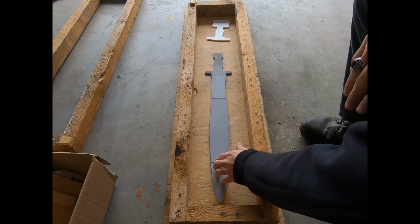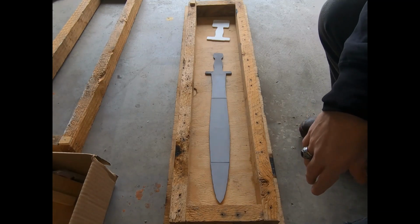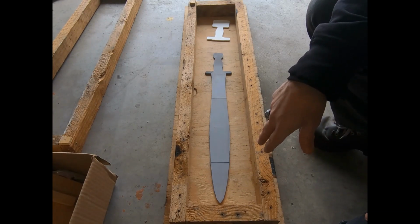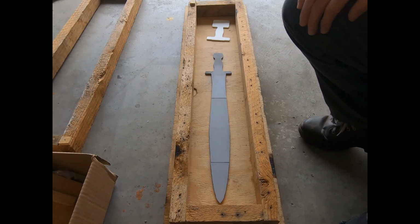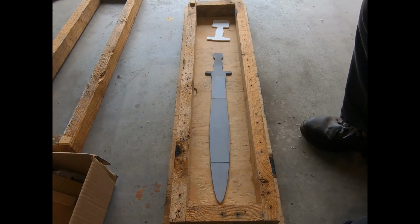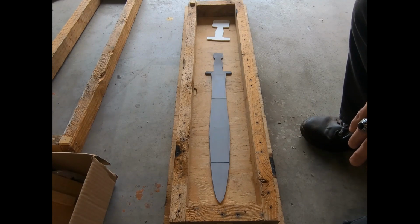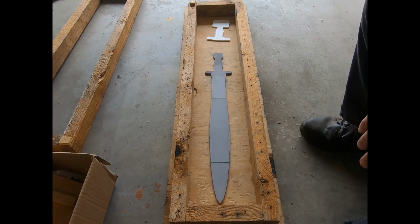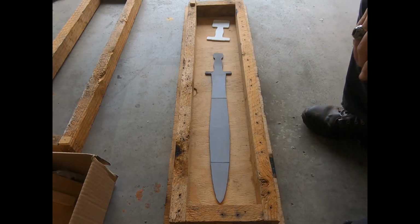And I think what I'm going to be able to do, we'll see if it happens in the video, is, in the mold itself, smooth out those seam lines. And I think I'll be okay there. It's beveled. It's got a draft all the way around, so that this should come cleanly out of the sand, with the expectation that when I've got my piece of metal, I can take care of it with the finish work. Okay, so this is the original intent.